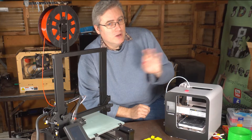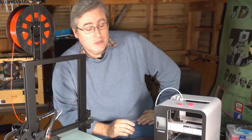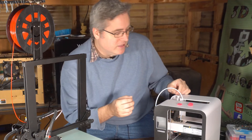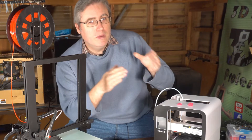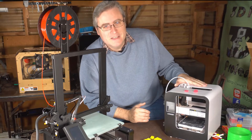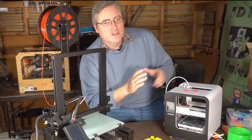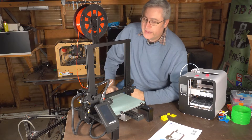Well, this printer, among all the ones that I tested, had a kind of unique problem. The circles on the bottom of the Legos were very clearly, visibly non-circular — they were kind of tilted and ovaled. Uniformly — it wasn't doing it differently on each layer, it was uniformly off every time. It's the sort of error that happens when you have a loose belt or the gear that drives the belt is loose and it just jigs a little bit. Every time the motor switches direction, there's a moment where the belt doesn't switch direction. That doesn't lessen my opinion of this printer much — it's still functional, it's simply not capable of measurable accuracy like a Lego. So, now move over to the LK4 Pro.